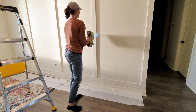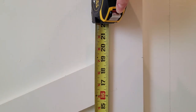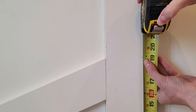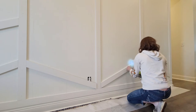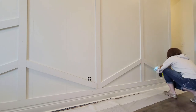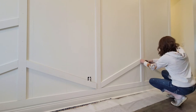I decided on a 22.5-degree cut angle for the herringbone boards. I measured and made my first cuts, then measured the top to make sure the boards lined up visually. For the first panel, I added the bottom and top boards first, then the center board, and then two more in between — five boards per panel. I liked the odd number and wanted a cohesive, symmetrical pattern with no floating board at the top.